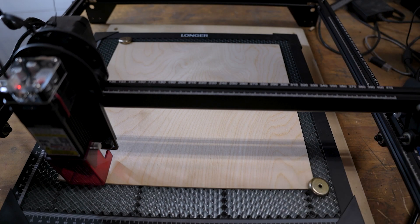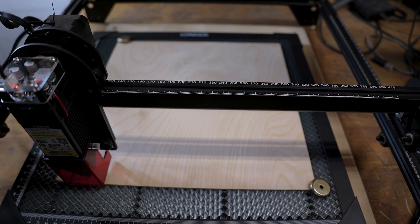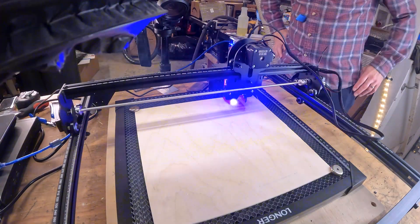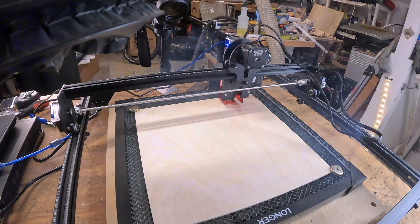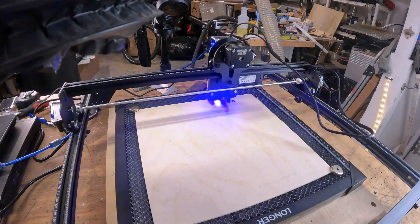It's a cut out of the wood and also an etch. Usually when you do this, you want to do your etching first rather than your cut first, because if you do your cut first it could drop down, set off your focus, and create issues. So do your etches first and your cut second. Going to get our ventilation fan on because we're burning wood and we don't want to breathe that in. That's going to take a little bit of time — it's saying 32 minutes, but I suspect it's going to be longer than that.